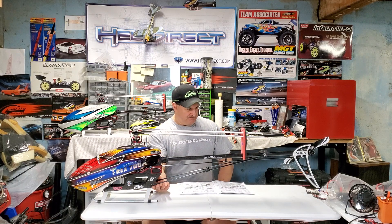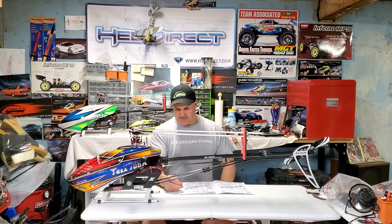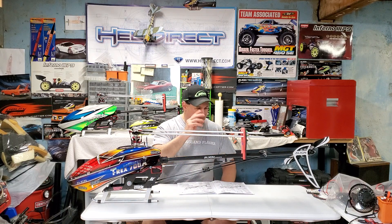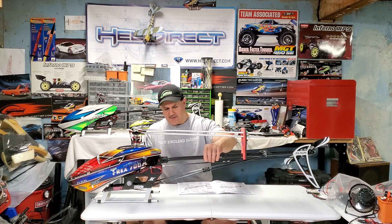As a precaution, since it did have some bad wag, I also cleaned the struts for the boom — both ends — with a wire brush and alcohol, re-applied Loctite, and retightened everything. The struts had actually come just a little bit loose, nothing major, but that was also an easy quick fix.